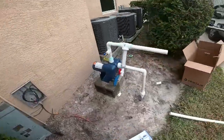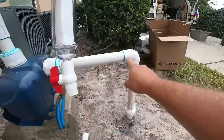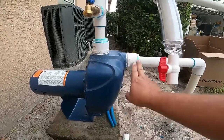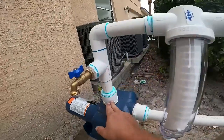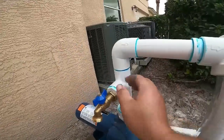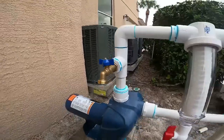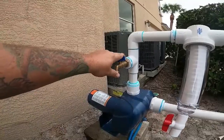What we have here is a two horsepower pump. I came in with my suction line — it's a two inch suction male adapter right here, broke it down to inch and a quarter because that's what the well is. This is a two inch discharge with a reducer. We also got a hose bib on here just in case they want to fill up their pool and not use city water, so we put this on there for them. It also helps if you want to prime it or if it loses prime.